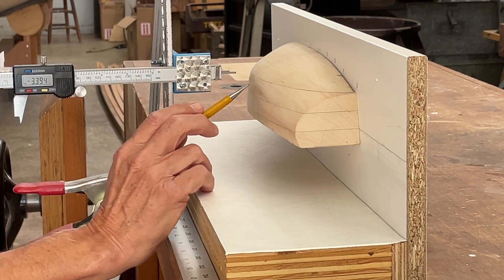Taking the points off the hull is a pretty straightforward process. I've already done stations from the stern up to amidship, which is station six, and that happens to be the aft side of the center seat bulkhead. So let me show you how we take points off of the model.